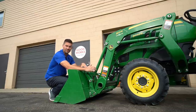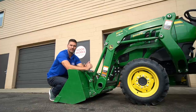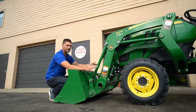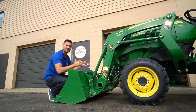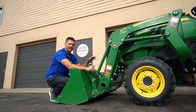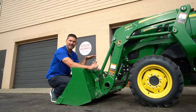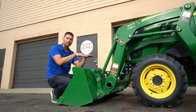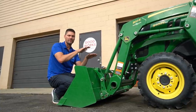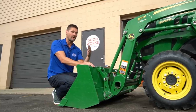We're talking about float on the front end of a tractor — with a loader and bucket, or maybe a snow plow or snow push on the front. If we talk about snow removal equipment as an example — and this also applies to a frame-mounted snow blower on the front — you're still using those same hydraulic controls. By engaging float and pushing that lever all the way forward into the float position, it's going to eliminate the down pressure — the force trying to drive the mechanism into the ground. Instead, it's literally going to float or glide and follow the contour of the ground, so it won't dig in and potentially damage surfaces like concrete or asphalt.